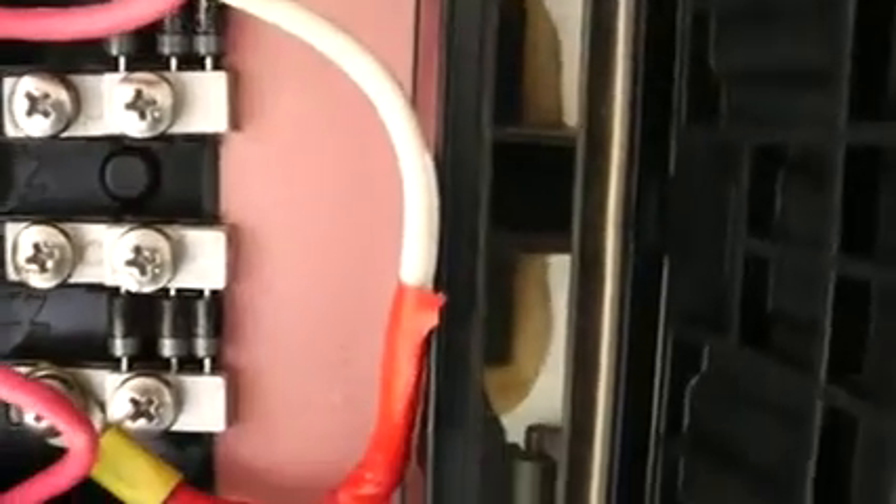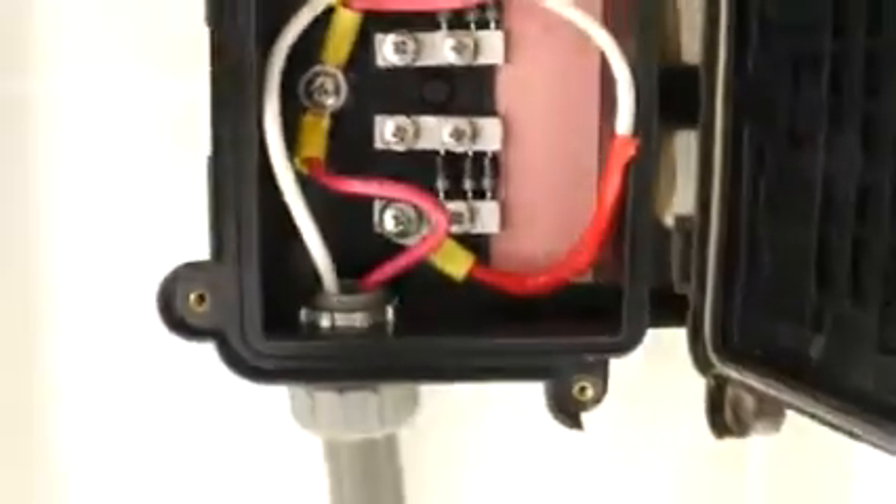You can also see in there the blocking diodes. This one has six blocking diodes. You'll generally want at least three in your system, and it doesn't matter too much where those are as long as they're wired into the circuit. I've seen them on both the positive and the negative side — you can see we've got some on the positive terminal here and on the negative terminal up here.